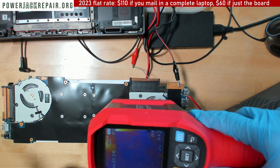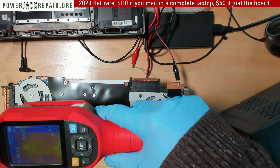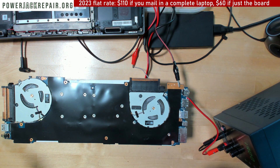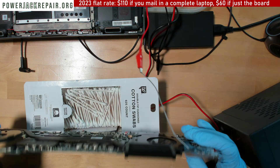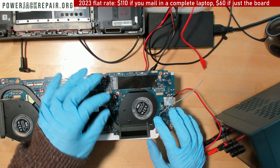Let's see on this end. Yeah, we got a heat spot right here, under the CPU or GPU. So this is no use. I'm obviously not going to replace the GPU or CPU on this laptop. We are pretty much done here. What I need to do is desolder the cable and put everything back together, because either this chip or that chip is heating up.